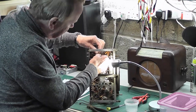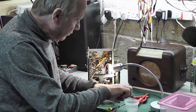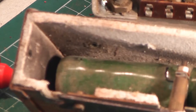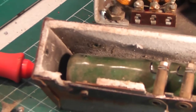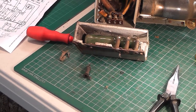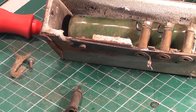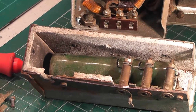It's really embedded in there. There it is — a rather mucky clip off the capacitor. There's the offending item removed, and you can see just at the top of that resistor the burn mark where the old connection was made. That resistor is now completely useless — there's no way I can restore it. As I say, it's going to be replaced by a high-power resistor. You can see the bit that's broken off — not very clever at all. And there's also the asbestos case, which is not a good idea.